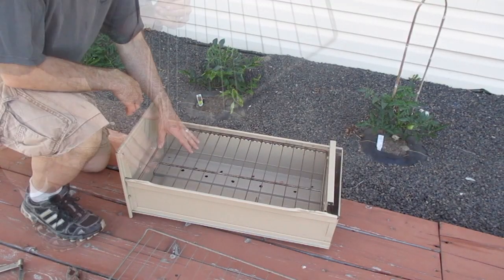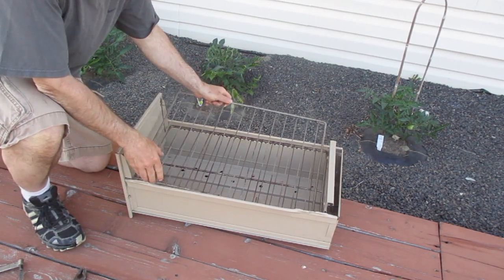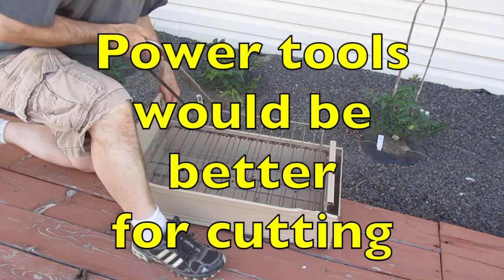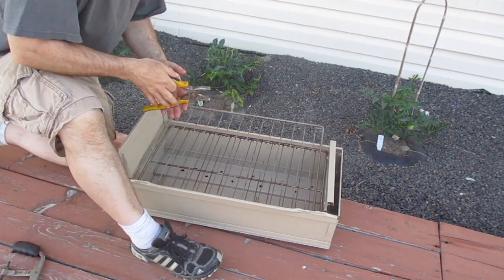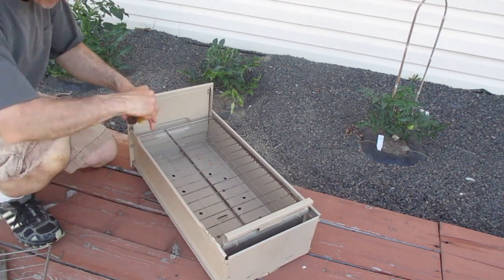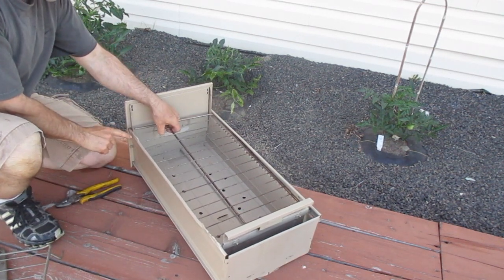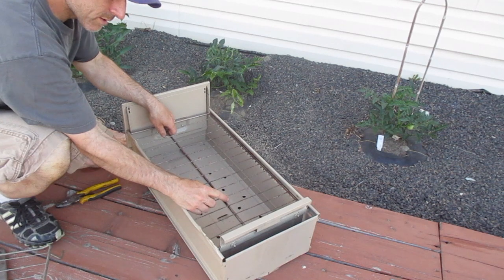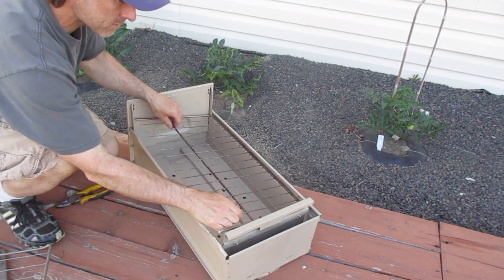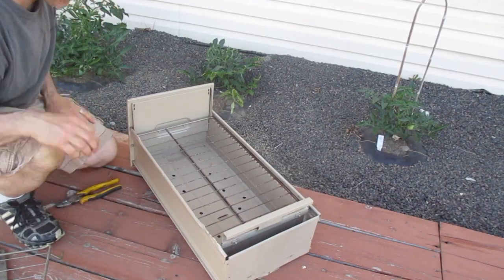I made these racks. I found some stoves that were being thrown away and I took the oven racks off. I propped one side up to figure out how far it needed to be, then sawed off the two main pieces and came through with a wire cutter. I used pliers to pull the ends back so I have a couple that are a little longer and can be pulled in and out, while the other ones just fit so I can remove and replace the rack.